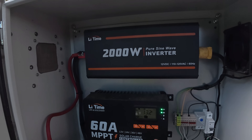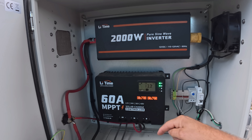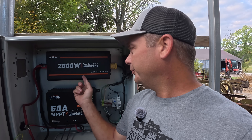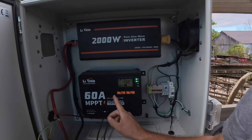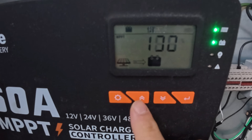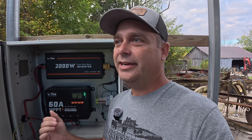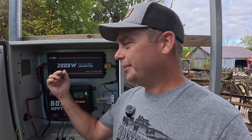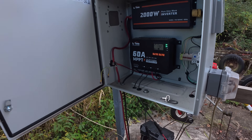What I've found about this combination of the 2000-watt inverter and charge controller: when the battery gets low, the first thing to shut down is the inverter — it turns off and beeps, and you can hear that beep fairly far away. But when you look at the charge controller and scroll up to see battery state of charge, a lot of times it'll be around 35–40 percent. To me, either the inverter is shutting off too early or the state of charge reading on the charge controller is incorrect — I'm just not sure which.